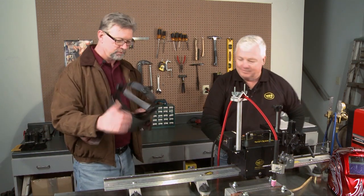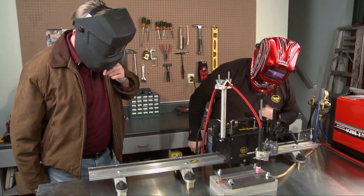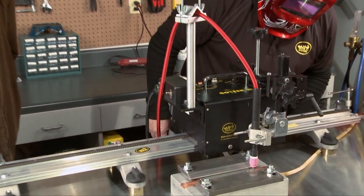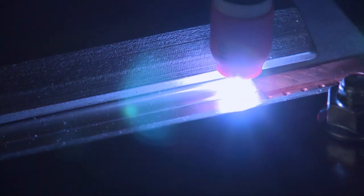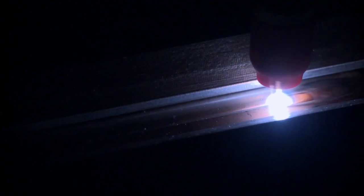I'm set up to run an 8-inch piece here — why don't you grab a helmet and we'll do a live test. You can see the arc and the puddle. It's got a background current of about 40, peaking at about 150 amps. Travel speed is about 8 inches a minute. The wall thickness of this material is about an eighth of an inch. Running argon gas with a gas lens to give it better shielding.